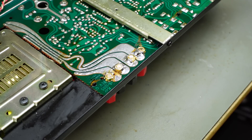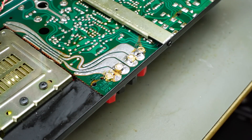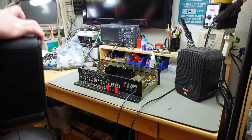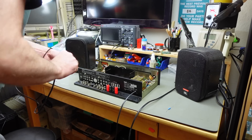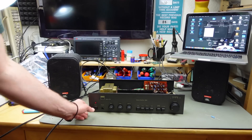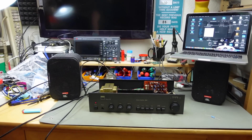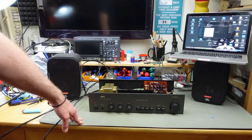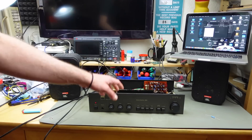This should now be rock solid and provide good contact with the traces. The trace is a bit cut on one end, but it makes really good contact on the other side of the post so I'm not too worried. I checked for shorts again — still none. Let's connect some speakers and test it out. This feels much more like a decent amp now with the new connectors. Good news everyone — this thing still works, and it's way easier to connect speakers now with the modern screw posts.